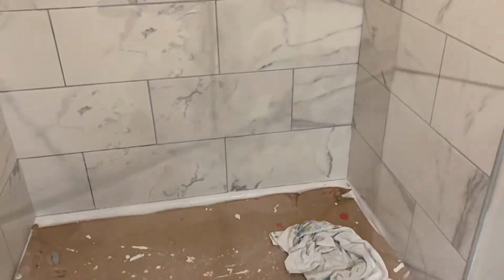The easy part, in my opinion, is applying the grout just like this, right? Push it in there and then smooth it out with your float. It doesn't have to be perfect. Your wet sponge will actually make it look really nice and finished, and you'll see what I mean once you try that out. And again, if you've not done this before, you're going to want to practice, right? Mix up a little test sample batch and get a couple of excess or extra tiles and just practice a little bit.